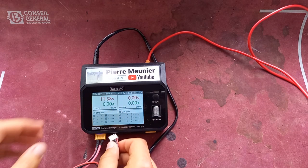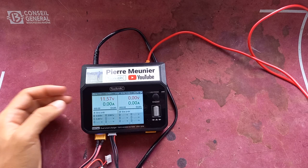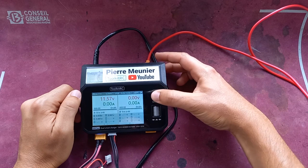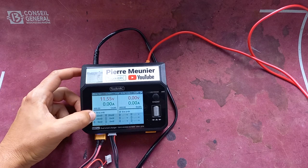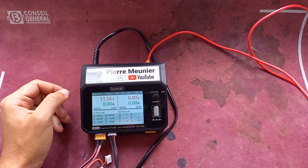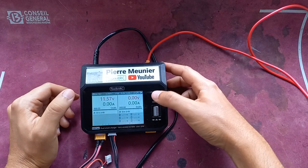In the menu you can see the voltage of each cell and the total battery voltage. If you want to do a quick internal resistance test, you just long-press the channel exit button, it beeps, and there you go — it shows you the internal resistance. It doesn't need to charge or discharge the battery, just a quick pull. I really like that because I need to check my batteries often to make sure they're healthy.